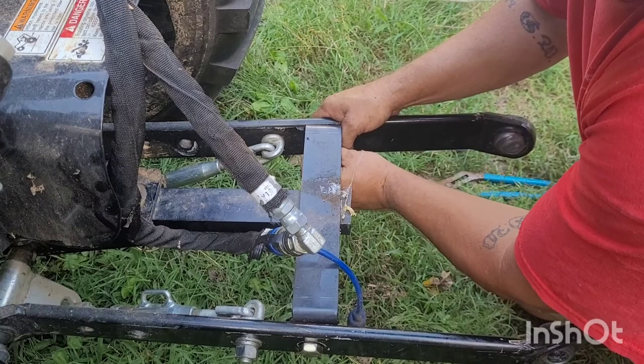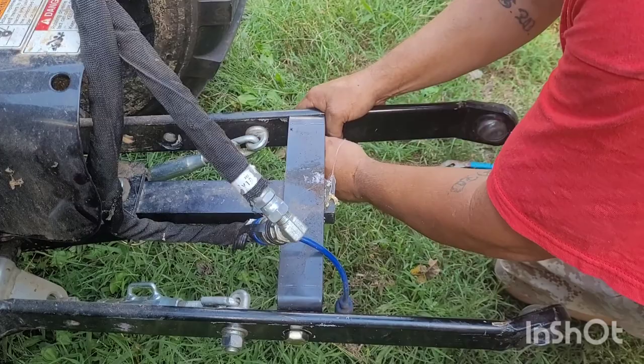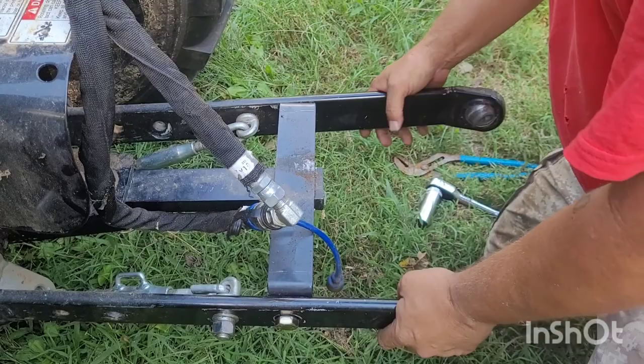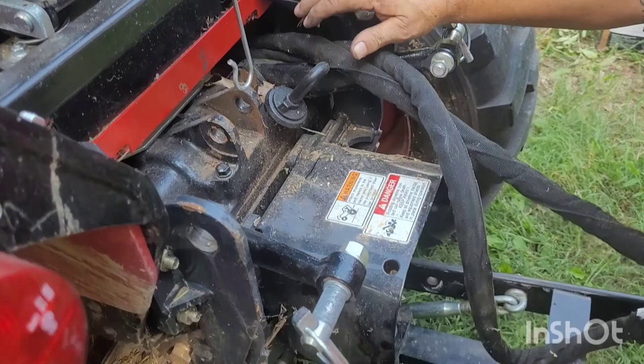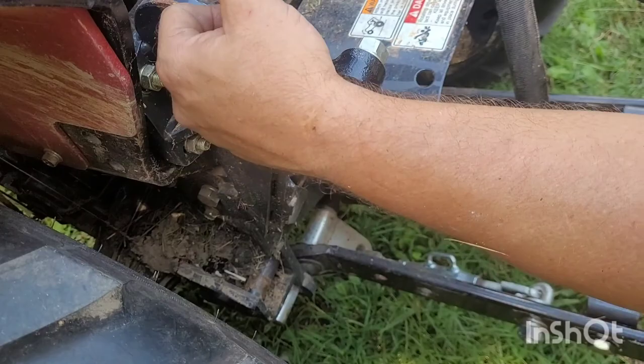This part is called the trailer hitch. So you took off the arms and put on the trailer hitch. All the hitch does is it just keeps these from moving once you get it locked in. Then once I get back on and turn my tractor on I'll raise these all the way up, because the backhoe attachment is going to sit right here and right here — down here is where it's going to go in, but the pins will be right here.